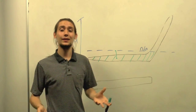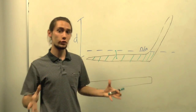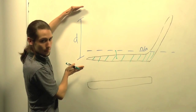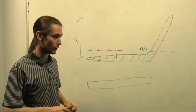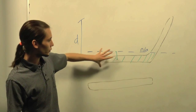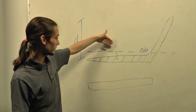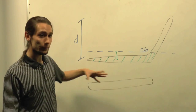The moment of inertia is basically dependent upon the amount of material we have in our cross section. So the bigger the cross section, the larger the moment of inertia, and also on the distance of the material in that cross section away from the neutral axis. So in general, the deeper the section around that plane, the larger the moment of inertia will be as well. So if we qualitatively compare the moments of inertia from this composite structure and from this section of the bench, which is just the seat without the back, we're going to see that in the case we've actually designed, the moment of inertia is a lot greater, and that's going to greatly increase the rotational resistance and therefore the bending resistance as well.